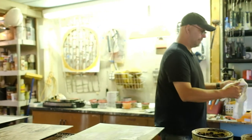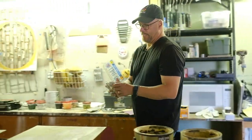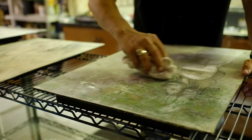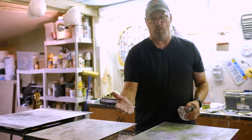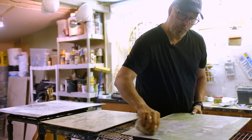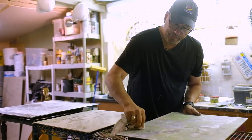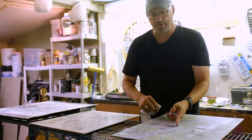We use a wet rag to get some of that dust off so you can see how it's starting to bring the colors in — that's just getting some of the dust off. The skim coat is so thin that if you do a white skim coat over it, you can go a little more wet and take it right down to the other colors with more pressure, pulling more of that skim coat off. So you can control it — I want more of these flowers to pop through that color. I'm really trying to get some of that top glaze off, and you can see how these colors are starting to really pop through.